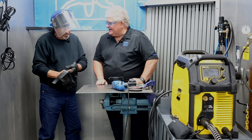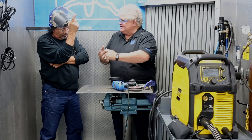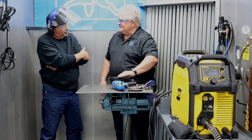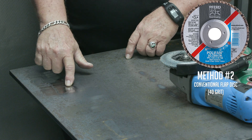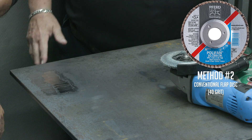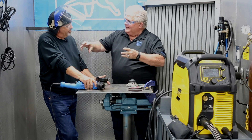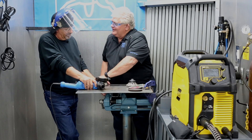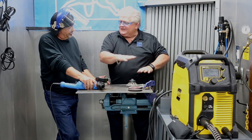So what is mill scale actually made of? It's made out of the impurities from the steel — excess coke in the material, oils, drying materials, all the things that got mixed in. You're heating them back up to about 1,800 degrees, because that's the actual friction you're creating. And what you're tending to do, especially on the oils and debris, is just starting to float them — just rearranging them, moving them back and forth. Think about four coats of paint on a car — you come in to grind it off and you literally liquefy it, and it lumps over here, and you push it back over here. You've exceeded the temperature of the mill scale and all you've done is started floating it all over the place. The madder you get and the harder you press, the more you just float it around.